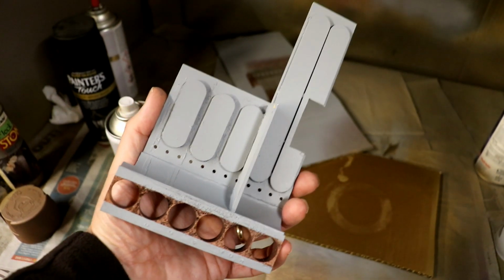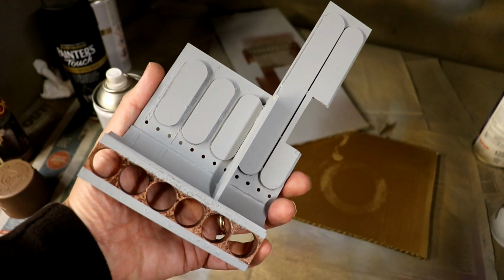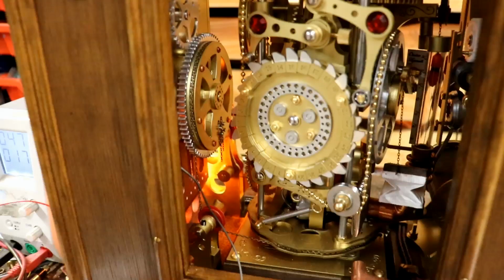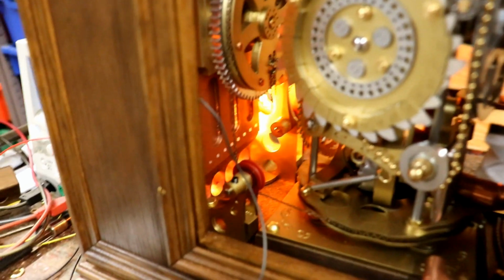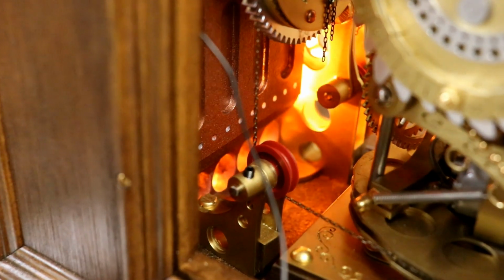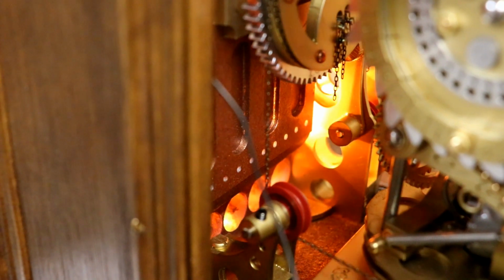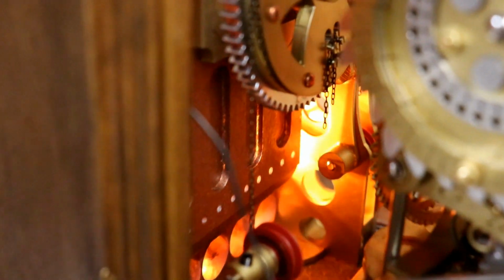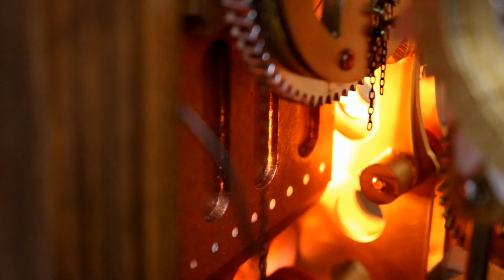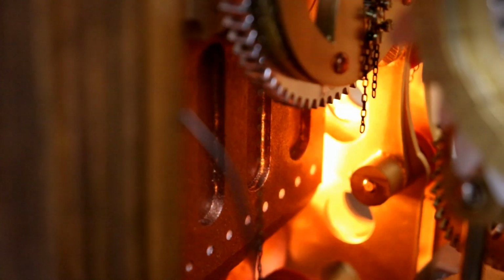Here we are. Several coats of primer, which is really thick and opaque and stops light going through, has set. That's not bad, because the flickering effect shines through the holes that I made in the bottom of the boiler. I need to glue the rivets in the holes. The only thing is that it's also still shining out through some of the bits that haven't got enough primer on, so I need to paint them black on the other side.